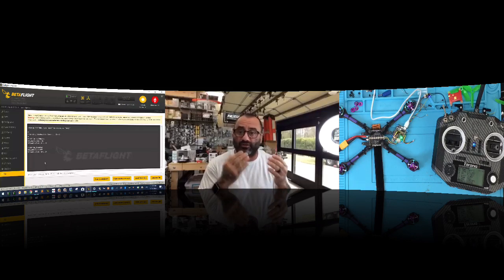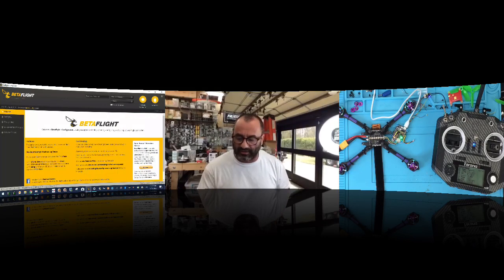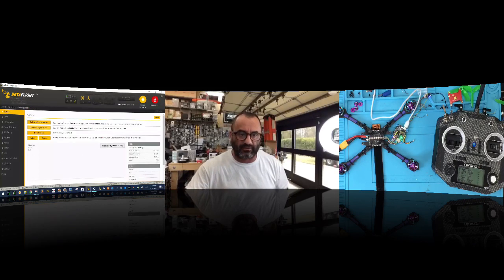With those two things set, you really should just be able to solder it, turn it on, and start getting the telemetry when you say discover new sensors. Right now, I'm just going to type exit, get out of this, get everything to start back up, and we're going to watch now. Once we've watched, you're going to see it start populating. So now you can see my VFAS, which is going to be my battery. We got 14.2, and there it is, 14.2. You've got pretty much everything here that you needed.